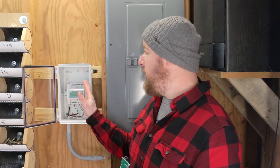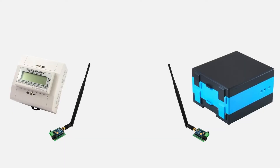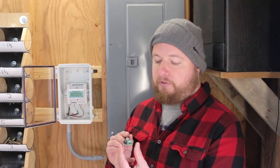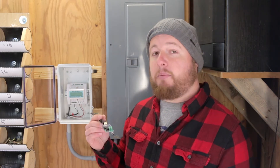However, for that first option you need a USB dongle hooked into your computer, and that USB dongle must be wired into your EKM meter to get into the software to turn those top ports on. You can also turn those ports on via the Push 3 once everything is set up. If that option doesn't work for you, we can go to option number two: right on the baseboard itself there is a 12-volt barrel jack — all we need is a transformer to plug right into there. That's probably the simplest and easiest way to do it.